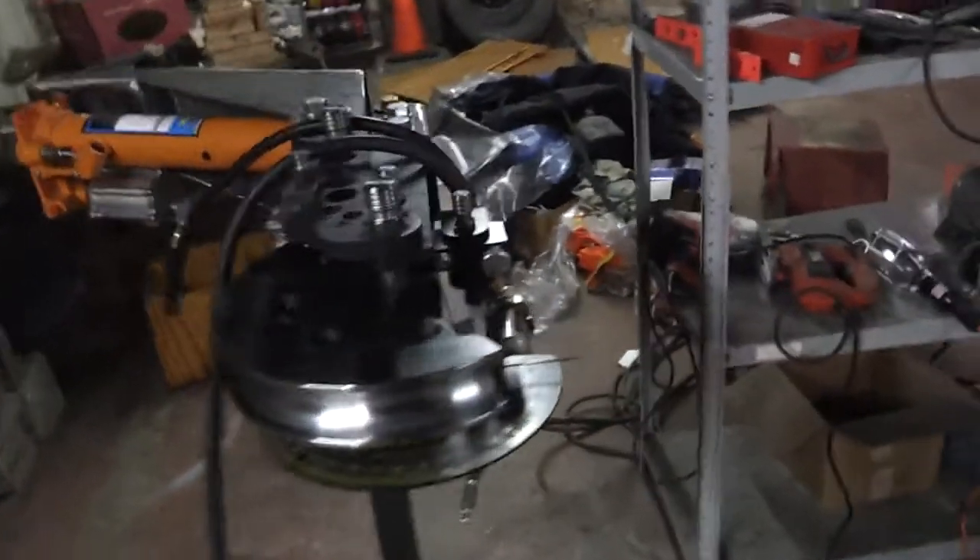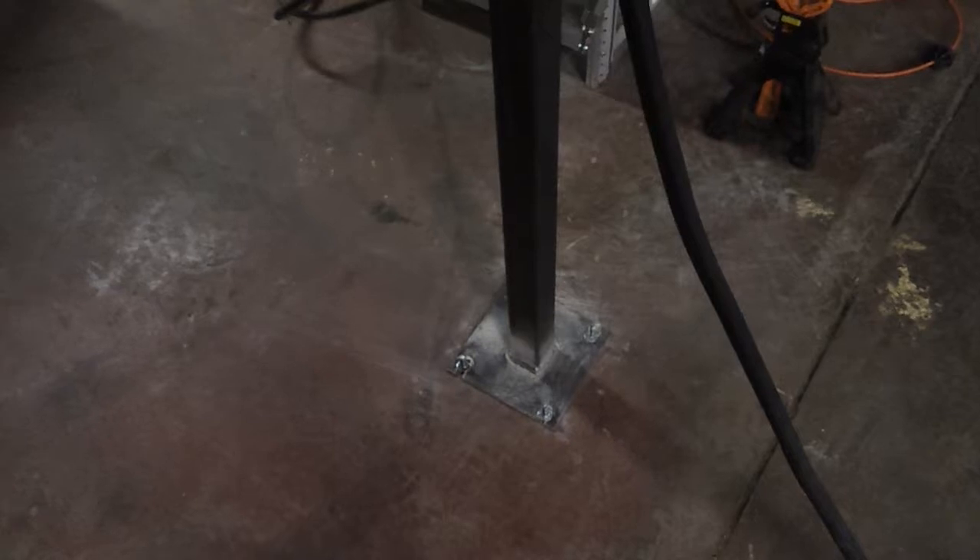This is not a permanent air setup — I plan on doing some work to the base here. Right now it's a little bit wobbly, and it's actually not the tubing, it's that base plate. That's some more three-sixteenths on the floor, and that's what's doing the flexing. So what I think I'm going to do is try to run some arms off here, diagonal, triangulating it, and bolt them to the floor.